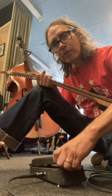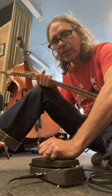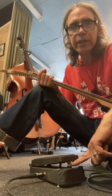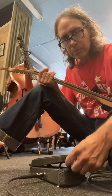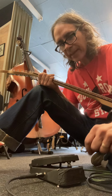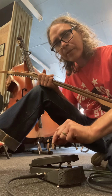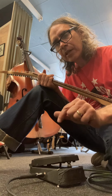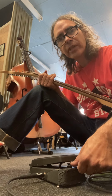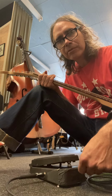Then I started to tweak where the pedal should be, just for the right time. And I realized when I went all the way down, I wanted the effect to shut off. I didn't want any fast echo. So I put a little momentary disconnect switch right here. Listen, that'll just disconnect. That was hard to do because I had to figure out how to disconnect the delay and not the guitar. I realized that if I just shorted out two of the lugs on the delay volume, it would bring the volume to nothing on the delay only. And it fit right in that spot where the regular Crybaby button is. Perfect, I couldn't believe it.